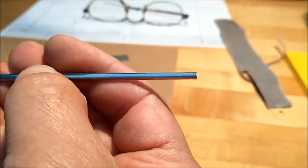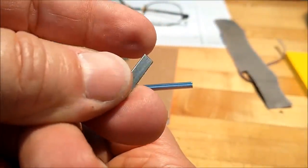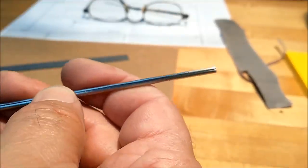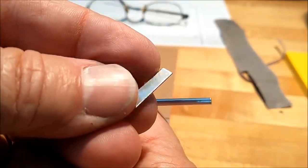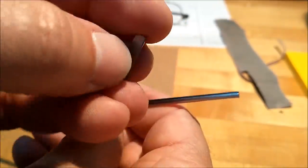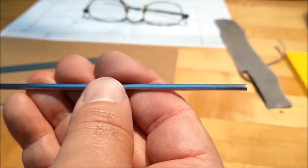The print calls for a 0.032 slot, which is what they got. But the keystock they give you — the piece of steel — is 0.035. So in my world, this is not going to fit this. Not yet. Sometime downstream, we're going to show you how to turn this into something that will fit, because it needs some machining as well. It needs to be turned into a little L — it is the key drive feature that slides as the carriage moves. And this is the thing you don't want to see your apron get tangled in, because I've seen that happen.